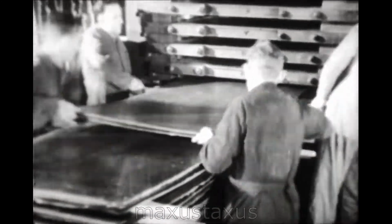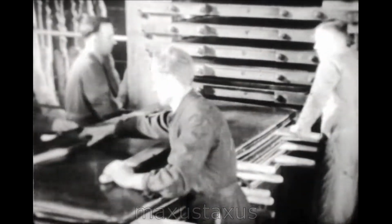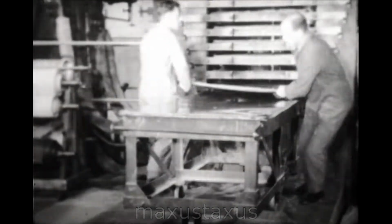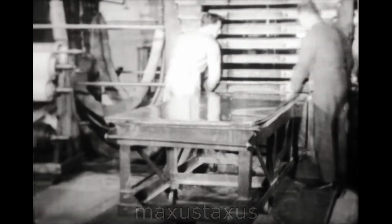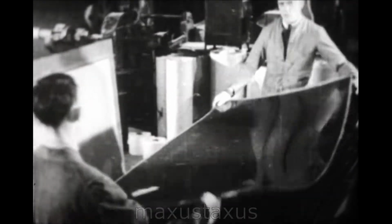This pack is subjected in the press to both heat and great pressure, and when removed, forms a sheet with a highly polished permanent finish, which requires no further processing and is ready for use as veneers for furniture or paneling of all kinds. Laminated sheet material is resistant to both heat and moisture and impervious to most acids and mild alkalis.